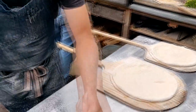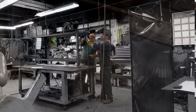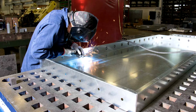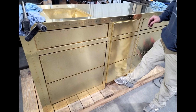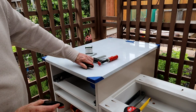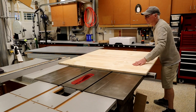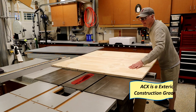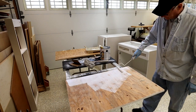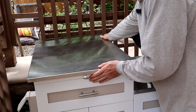I was told the stainless steel tables are durable and a nice surface to spread dough. After seeing how well they worked at the farm, I approached a local sheet metal fabricator to get something similar for my pizza station. The fabricator gave me suggestions on best practices for an outdoor kitchen, and we discussed making the overhang of the countertop large enough to act as an umbrella over the cabinets to protect them from the weather. To prepare for the stainless, I first built the countertop substrate using three-quarter ACX plywood and primed it on all six sides. Once attached to the cabinets, the stainless drops over it and acts like a hat — it fits just like a glove.